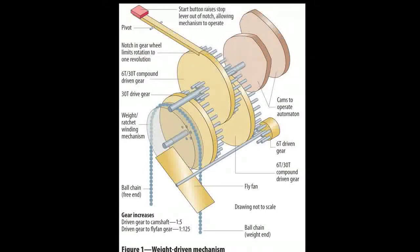That's all well and good, but I needed some way of limiting the speed. So the second gear turns a third gear, again at 1 to 5, which turns a fourth gear at the same ratio. So from the first gear to the fourth gear, the overall ratio is 1 to 125 — when the first gear turns once, the fourth gear turns 125 times.